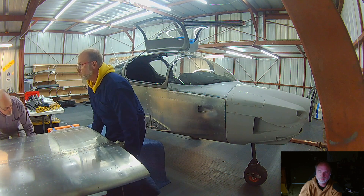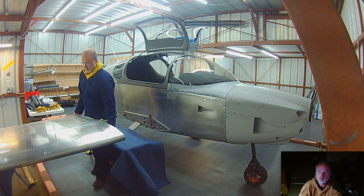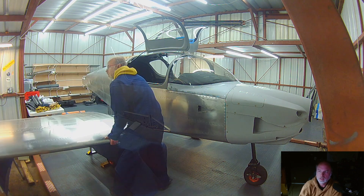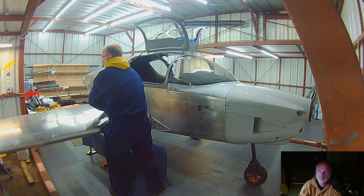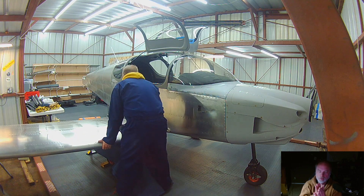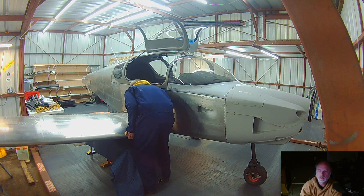It's just two or four regular bolts holding it in place, and you can't reuse those. The process of getting the wing installed is definitely a two-person job — totally doable with two people though. The real trick is getting it guided correctly into the carry-through spar, and equally important is making sure the rear spar lines up correctly. There's a bit of overlap on a couple pieces of material on the rear spar, so you have to make sure both of those fit in between correctly.